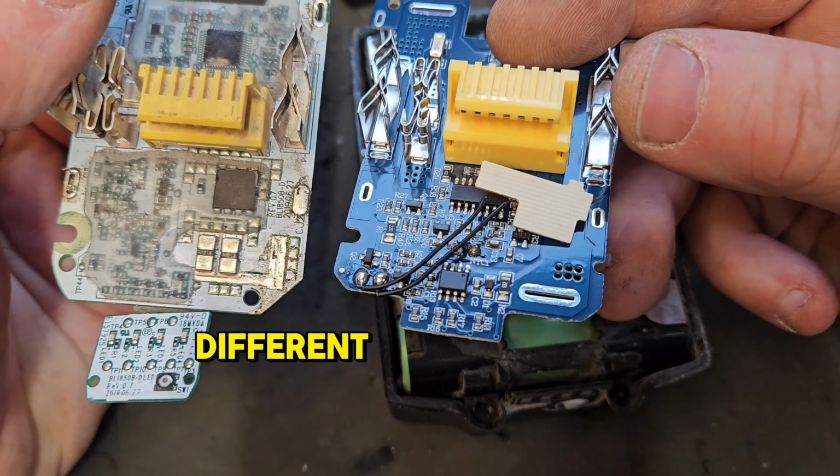At the top of the battery there are no obvious broken connections. Check this battery. We're getting 0.25 of a volt in the first bank of cells. The second bank of cells, no increase. No increase there. No increase there. So really, there's 0.25 in this front bank of cells and there's nothing in the rest, so that battery pack is completely gone. All the cells are completely kaput in it.